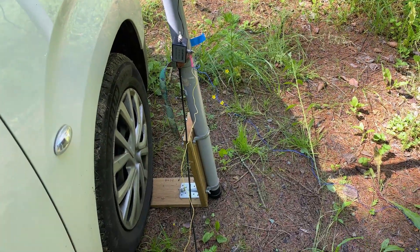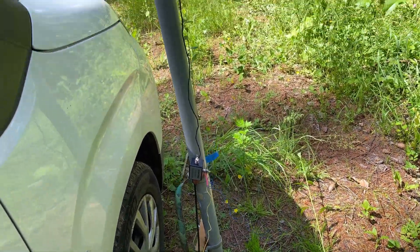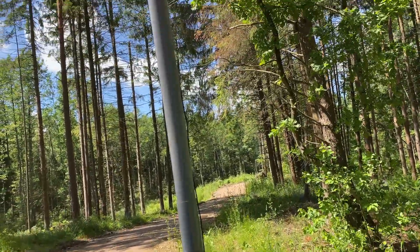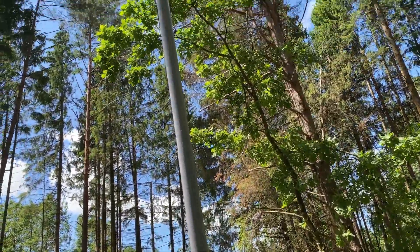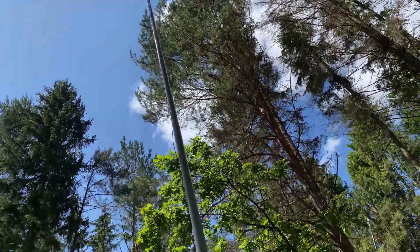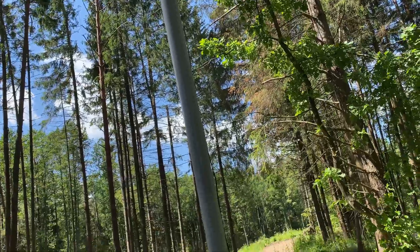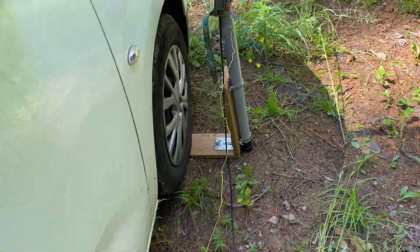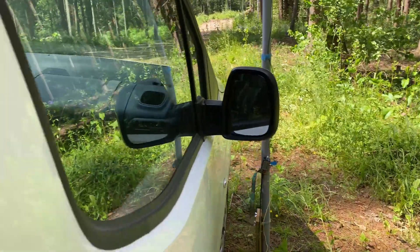The 29-foot antenna is the shortest officially approved random wire length recommended for a vertical, which should tune to all bands — even 80 meters — but normally 40 to 10 meters, or to 6 meters. Let's see now what's inside.